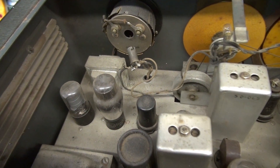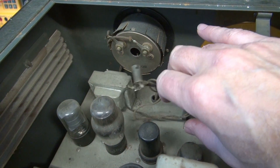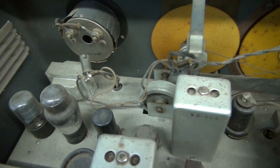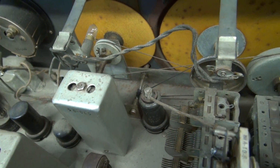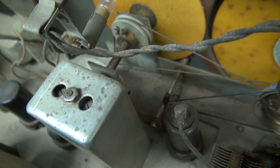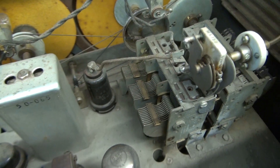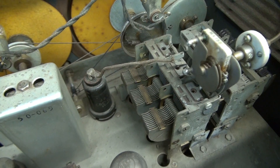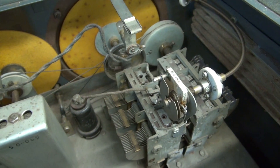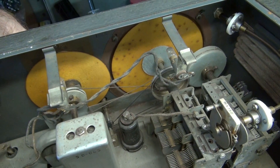Here's the inside from a different view. The lamp for the S-meter has popped out — I believe there's supposed to be a rubber grommet, so we're going to leave that hanging there. Dial cords are connected, but if you look down at the shaft on the main tuning cord, it's about ready to pop. Tuning cap looks okay, and we've got this weird variable cap that's been added — I'm guessing that was an antenna trim adjust.